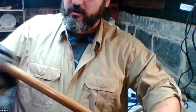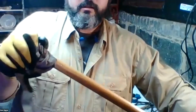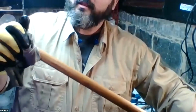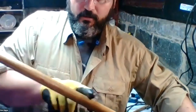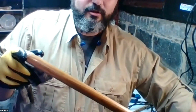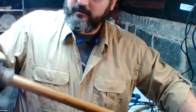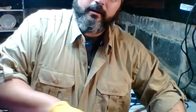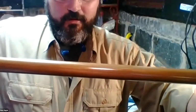It has a wood darkening effect. And I always want to make sure that I get a good dose onto that end grain, because you think about how wood fibers work. They run in parallel, and the end grain is kind of the hollow end of the tube where any liquids can get soaked up. So you can get a fair amount of oil impregnated into the wood if you liberally treat the end grain. So it's not shiny like this anymore, but it's just got a very dull sheen.